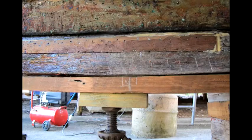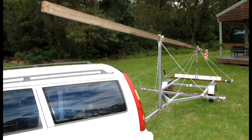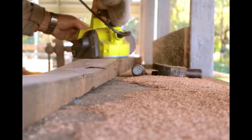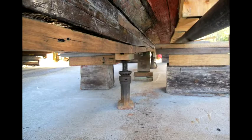A string line along the keel revealed a protrusion about one meter long and 25 millimeters deep, which had come about because of an earlier repair of the aft section of the keel. The replacement sacrificial keel, from one length of 50 by 110 millimeter hardwood, has been shaped to allow for the curve of the protrusion, and once in place will strengthen and straighten the keel.